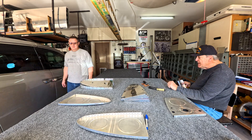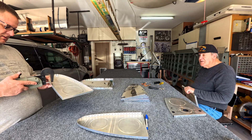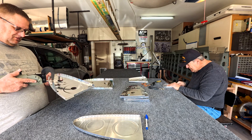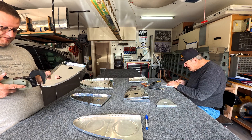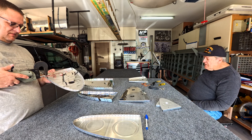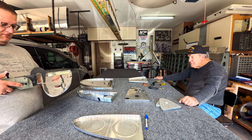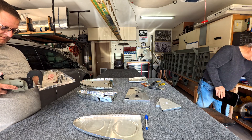I am making a mistake right here and I'll point it out. I'll try to put a link to the Vans video for doing the tanks. You should scuff those edges that are going to get tank sealant on them BEFORE you dimple them. That's a mistake I made — it wasn't on camera because it was two hours of my life I'll never get back. Don't make that mistake. Scuff the edges of the ribs before you dimple them so you don't have to go back and scuff inside the dimples themselves.